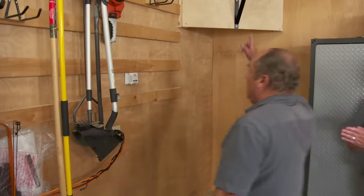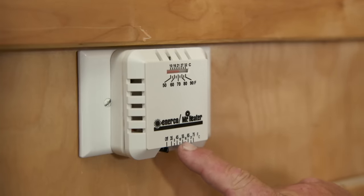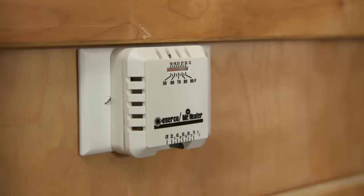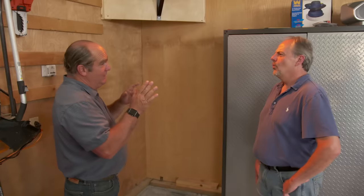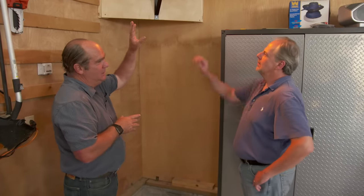We have fed a wire from the unit right to this location — here's our thermostat right here. You can see the settings are relatively low; you can set this to 55 and still feel comfortable. This unit has a pilot in it, and when that pilot is burning, it will generate enough electricity to operate the thermostat, but it also means you'll have heat even when you don't have power. So feel it? There it is. It's a hot summer day right now so you're not going to appreciate it, but you will in an Akron winter. You bet I will. Thank you so much — have a warm winter.